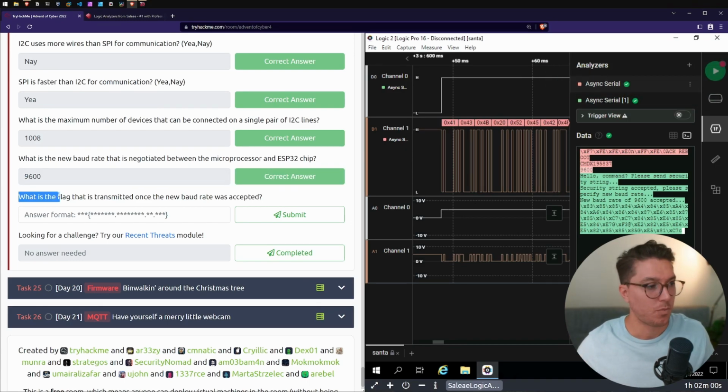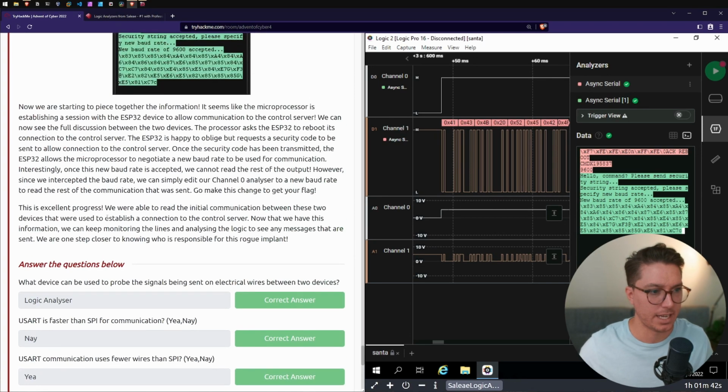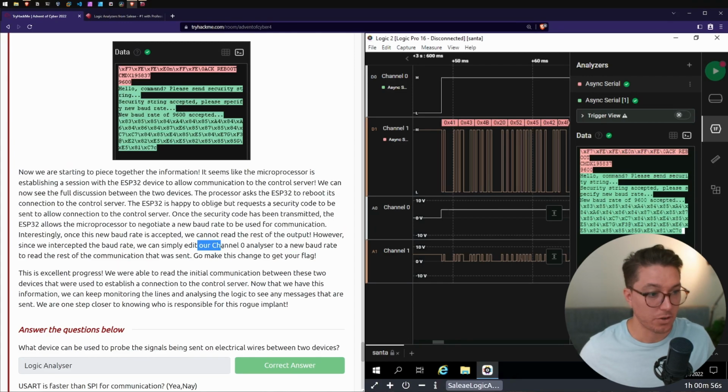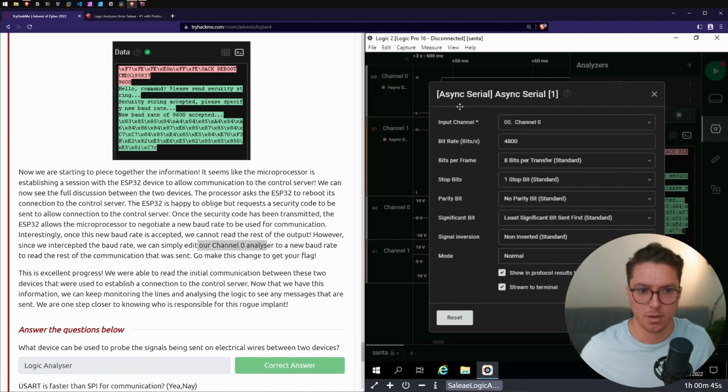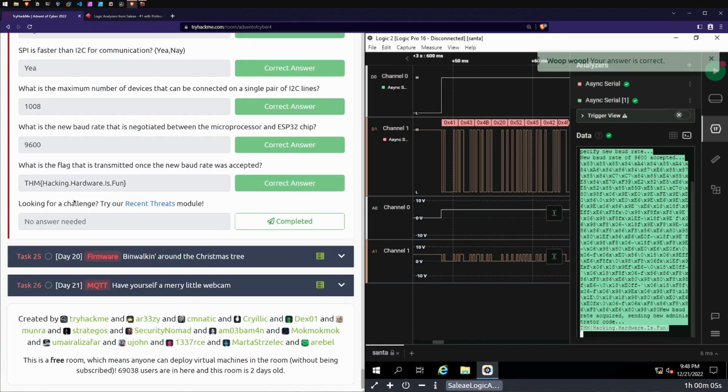On that one. Last up, what is the flag that is transmitted once the new baud rate was accepted? All right, so this is the last area for us, to get our flag. Let's go over this again. We need to edit our channel 0 analyzer with the new baud rate. So our new baud rate is 9600. If we go up and edit our channel 0 and we change this to 9600, easy there. And then we hit save, and there it is. We've got our code.